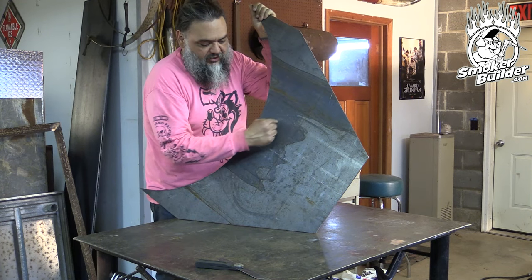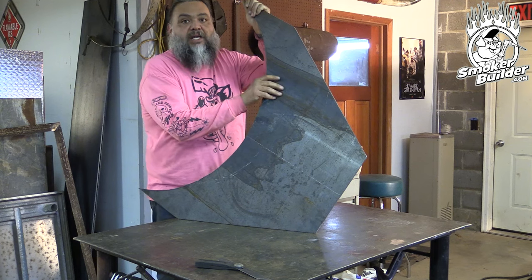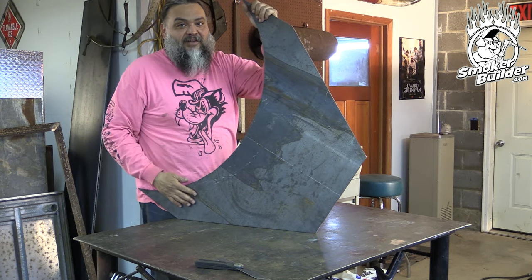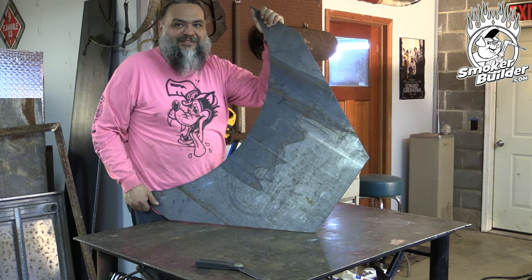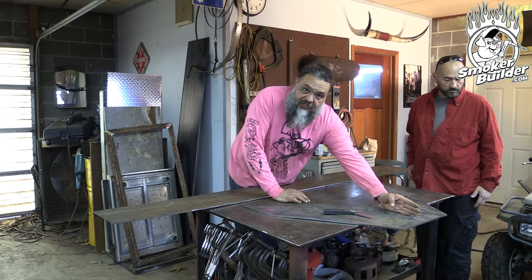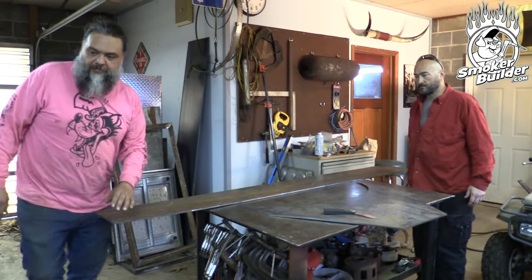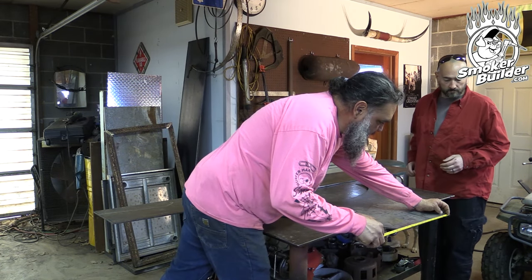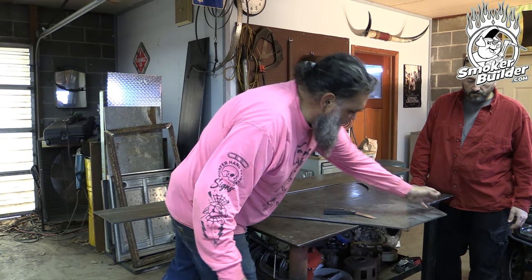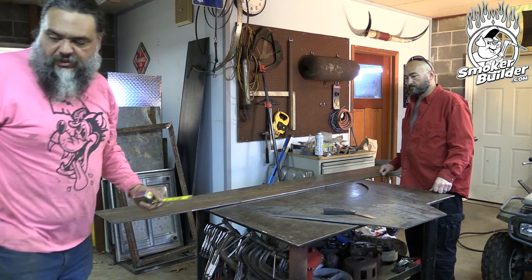Envision a big circle for the stack collector — we'll have the same shape on top and bottom, and the piece we're making connects those two together, forming a three-piece box. First we find center, then determine the two bend points. From point to point on the manifold is 14 inches, so we find center, split it, and make our 14-inch marks.